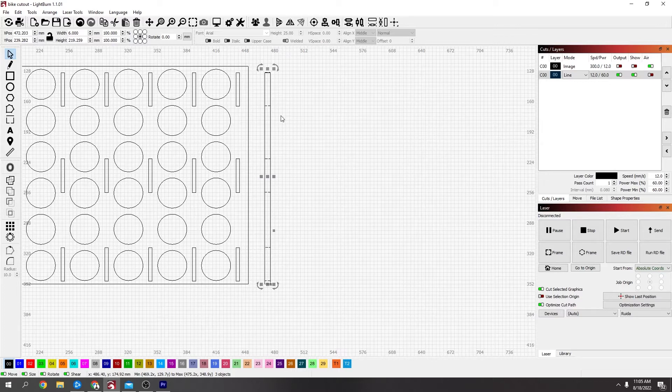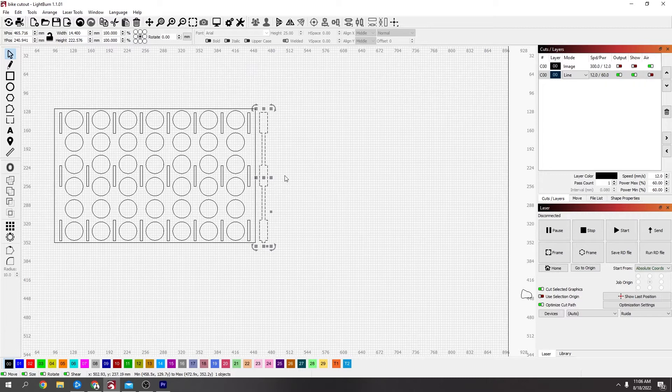The tab needs to stick out on either side to hold the wood. My wood is 4.2 millimeters thick, so I need that sticking out both sides. I add plus 8.4 millimeters to give me 4.2 millimeters out each side. While these are selected, group them, then hold Ctrl and select your other object and take everything from the center. Now you've got six millimeter spacing and these will slot into your slots — you need six of them for the six center columns.